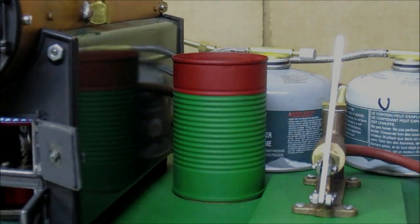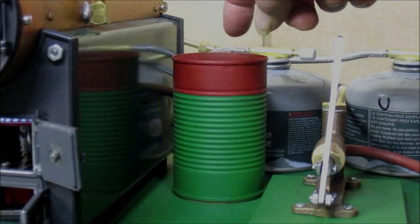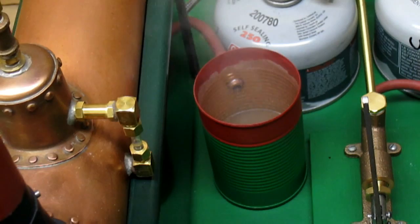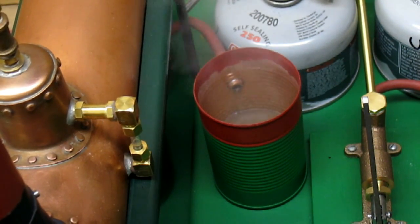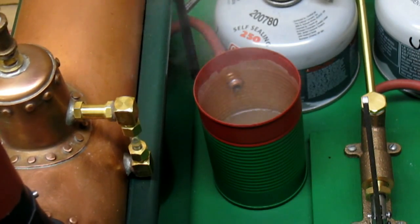The PMR 1880s drilling engine does not recycle the steam the way I have it set up. I am not capturing the water from the spent steam and returning it to the boiler through a pressurized pump. So instead we simply vent the steam into this can which catches any water coming with it. I suppose I could feed that back into the water supply to make the incoming water warmer, and therefore pump warmer water back into the boiler.